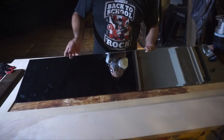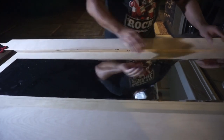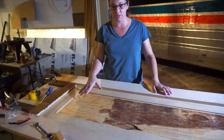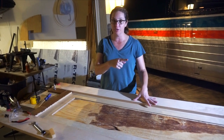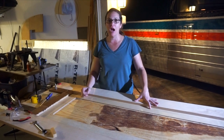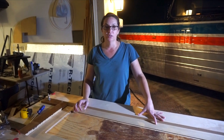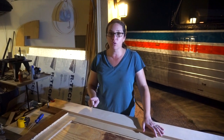All right, we're going to test and make sure that fits right. The rounded corners won't let it go in, but once we fix the rounded corners it should. Okay, so we need to just make those 90-degree corners. So we got the centerpiece cut out of our quarter-inch plywood so the mirror will sit directly in there, directly on the back of the three-quarter ply from the first part of the door. But we decided we didn't want to use a mirror adhesive because if that mirror ever broke, it would be really hard to get off the door and replace.